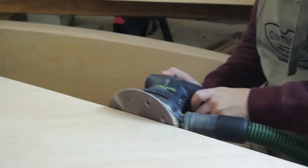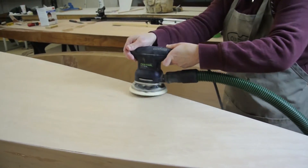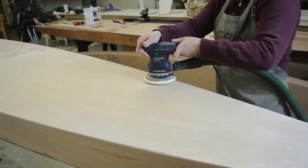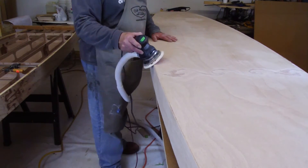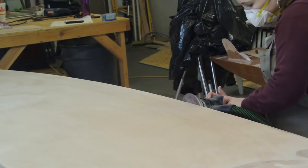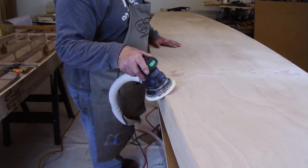Use a 4x4 palm sander or a 5 inch random orbital sander with 100 grit paper to round over the edges. Turn the boat over and start with the bottom edge first. It is best to use a consistent motion to round over the edge. Work the edge with a circular motion, starting with the sander flat to the side of the boat then rolling up so the sander is flat to the top. Do this while constantly moving the sander forward and back in an area about 10 inches long. Never stop the motion leaving the sander to sit in one position.